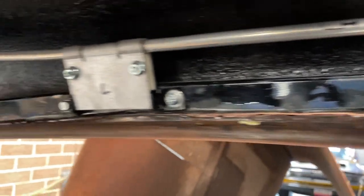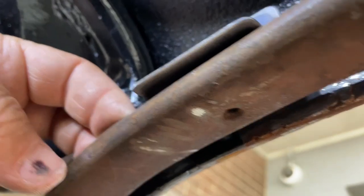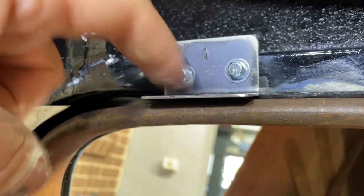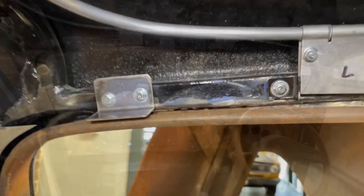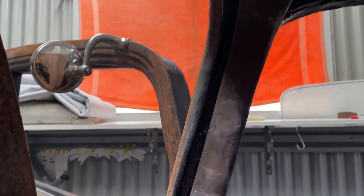There are a few more that'll go along here. With all these brackets done — I even numbered them to make sure I can put them back in the same spot on a later date. I can pull it out to where it needs to be, mark up through here and put a screw or a riv nut right through there, and these screws will run straight up through here. That's just to hold the top of the dash in. I'm not going to do it right now because I'm not exactly sure where it's going to sit once the screen's in — it'll be around about 12mm off, but I can worry about that later. At least the brackets are done and ready for the screen to go in.